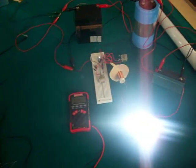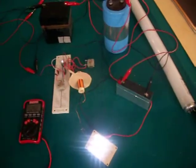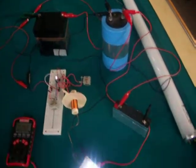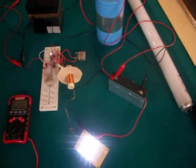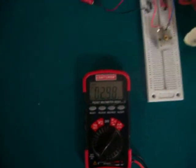In this video I have the small exciter running off a 12 volt battery, lighting nine 10 millimeter LEDs, going through the LEDs to this capacitor and then back to this other charge battery. Right now it's using just under 3 milliamps.